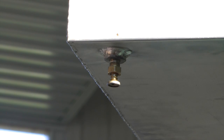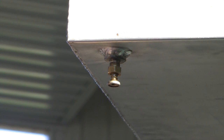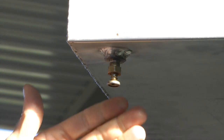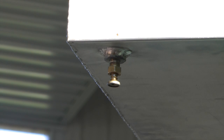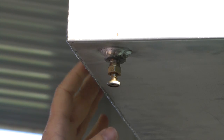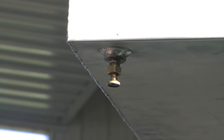One of the most common complaints about using these fuel drains is that they sometimes leak, drip, or ooze fuel. Especially these spring-loaded ones — when you release it, you expect the fuel to stop, and sometimes you may see them drip or ooze. There are two reasons for this happening. Remember that these drains are always located at the lowest point of your fuel tank or fuel system, which means sediment or dirt inside the tank is going to try to pass right through this valve.